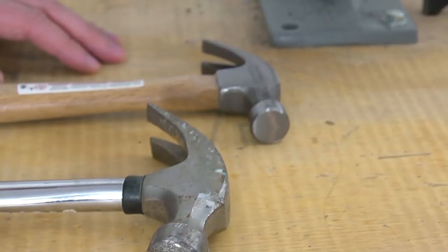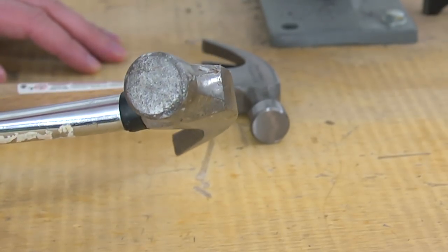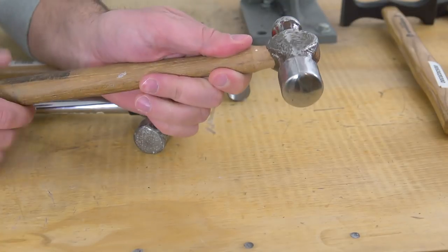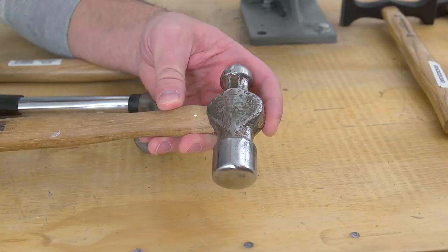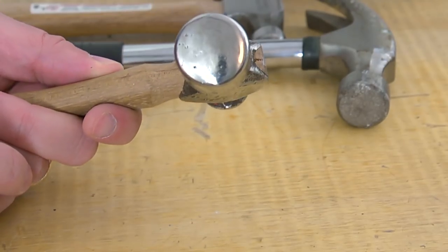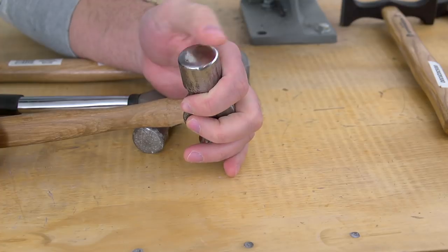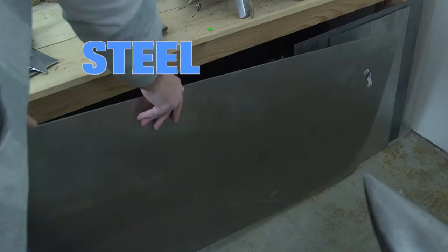In order to address that issue, even if your hammer looks really bad, you can polish it. If you have a sander you can do that, or sand it by hand and bring it to a very nice high mirror polish like this one. This is a ball peen hammer — an old secondhand one I got at a garage sale. I put a new handle on it and brought it to a very high polish, and it works very well. Even though it has some very deep marks in it, because they're so deep they really don't leave any marks on the metal, and that's what we want.